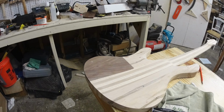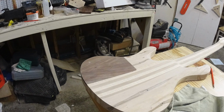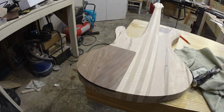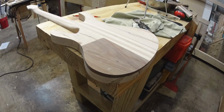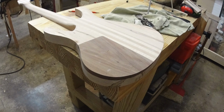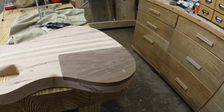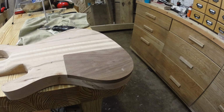Of course, something had to go wrong, and fortunately for me, it was a camera. So I'll just have to show pictures of the finished product. The process for making the cover plate is simple. Now, I didn't say easy, I said simple. I have to slowly work my way, sanding, planing, cutting, to fit the inside edges to match the routing on the body. Now once that's done, it's a matter of tracing the outside edge along the outside of the body, cutting away the excess, and using a router to perfectly flush out the cover edge to the body.